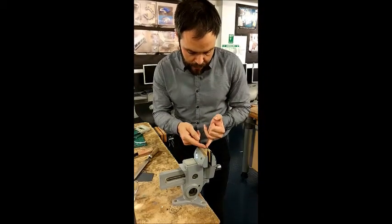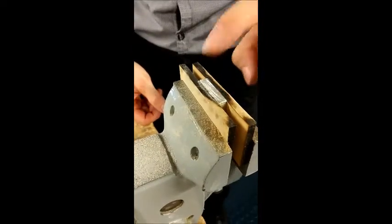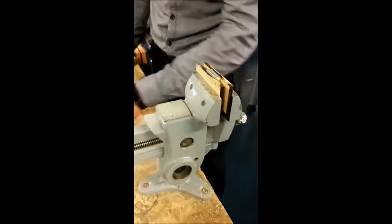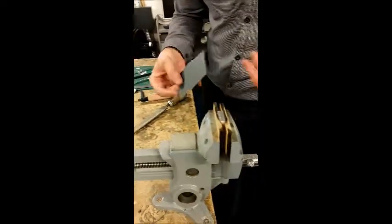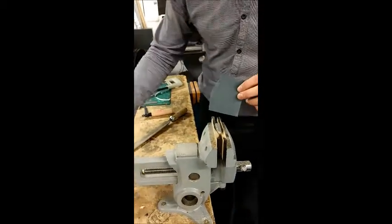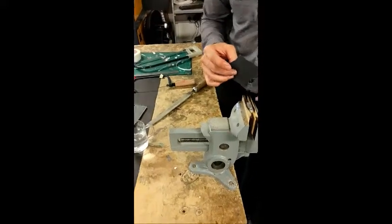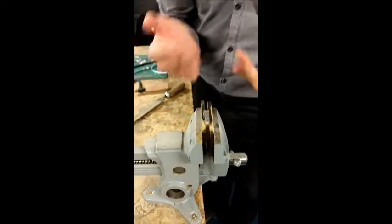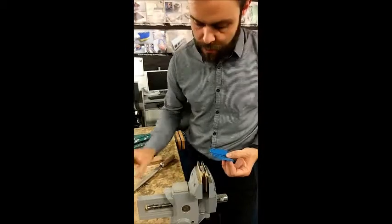In the last video I was draw filing the top to get it almost perfect, almost as smooth as it can be. To refine it further, I'm going to use what's commonly called wet and dry paper, or aluminium oxide paper as it's also known. It's called wet and dry because you can use it dry, or apply a little bit of water to your work. The water helps to keep the paper clean and stops it clogging up with waste pewter. It also causes the pewter and water to mix and form an abrasive slurry, which helps to refine the edge further.